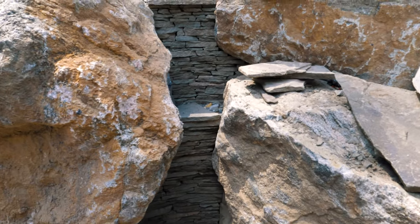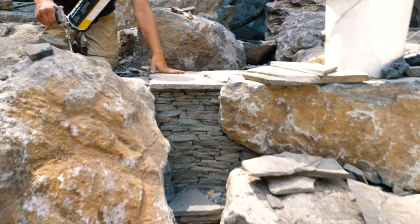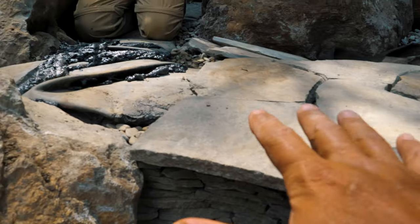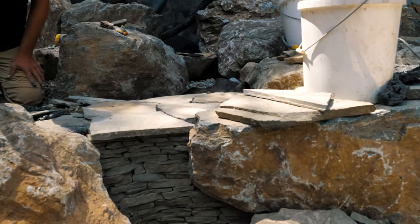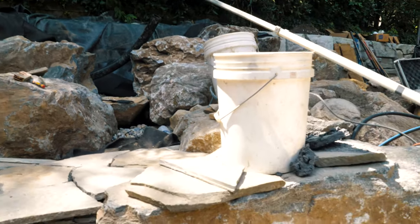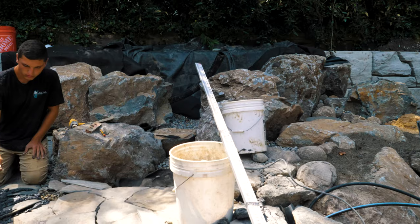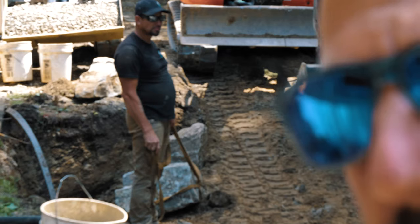We intentionally left gaps in between so we could do some slate work. Ant took that from the bottom — which is almost three feet deep — all the way up to the top where the waterfall is going to be coming into the pond. How sweet does that look? It's going on top of that block wall with some flagging work. We kept all this rock work real low to complete the look of it, and then we're going to have a waterfall back here — that's our main drop coming out from the top. Everything here is on top of our wetland filter, which is not something you see every day. But given that this yard is so compact, we had to figure out a way to include all this so it still filters right but looks awesome with the waterfall facing right at that picture window. Bowie is impatiently waiting for me to get back to work — I'm going to put the camera down and keep rocking.